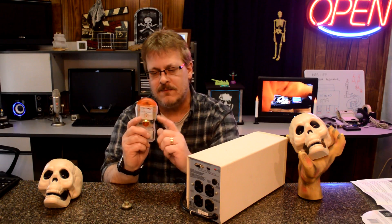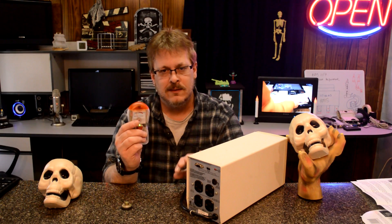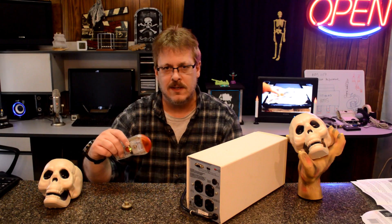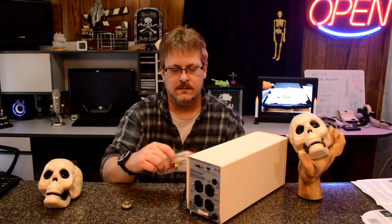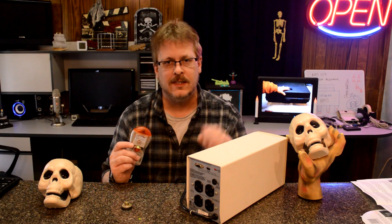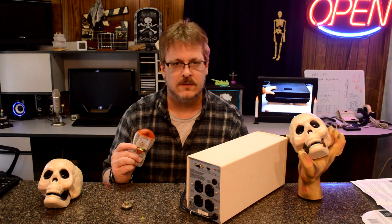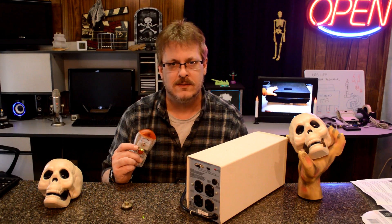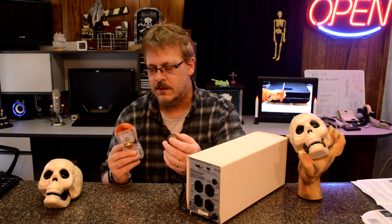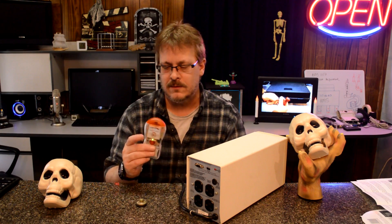A way that you can set this off — hence the name EMF — is electrical signals. This UPS power supply emits quite a bit of EMF. The closer I get, the more it reacts. Manufacturers of electronics try to reduce EMF because it can interfere with radio frequencies and cell phones. But some items, especially older items, do emit EMF because strict regulations weren't in effect in the early years. Also magnets — this is a magnet out of a speaker — so it's both magnetic as well as electrical. That's how this thing works.